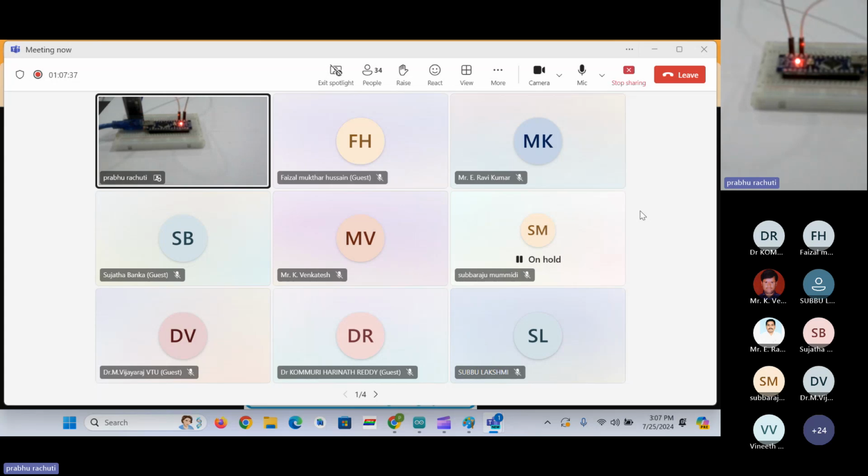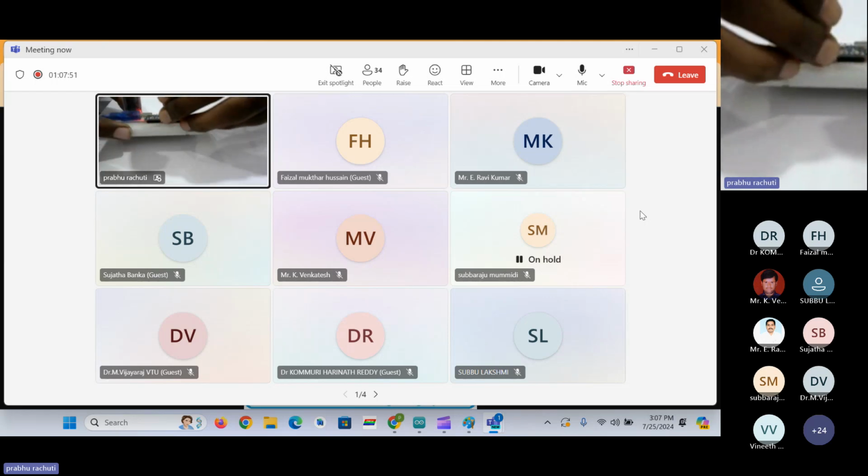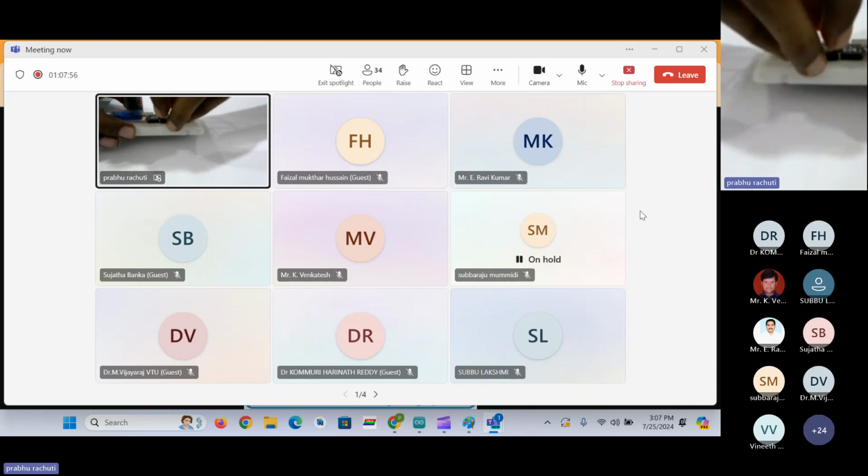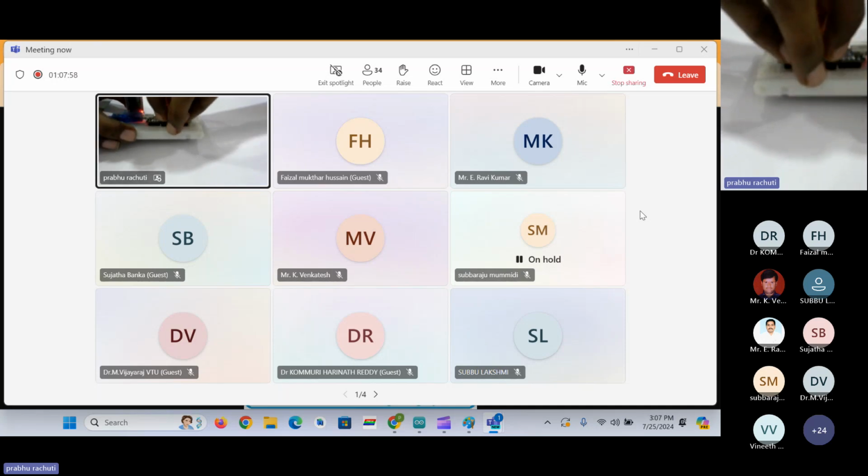So the module has powered on. You can see the light started to blink in the video. And then the TX and RX pins with respect to the code. So TX should be connected to RX. So I will connect it to 7, because 7 and 8 we have defined in the code. Whatever digital pins, you can use them for the serial communication code.